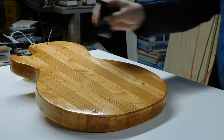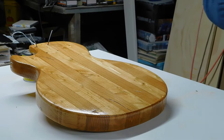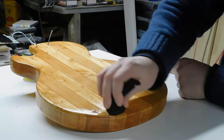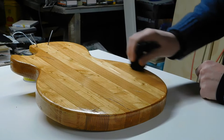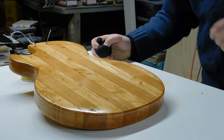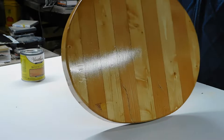On coat eight I began to feel like I was nearing completion. None of the articles or videos I'd found really mentioned what to look for as you finish the process, but it seems obvious in hindsight. The difference was that it went from feeling like dragging a damp rag across wood fibers to feeling like rubbing oil across a glossy finish. When you get to that point where you can feel that difference, you know you're in the home stretch.